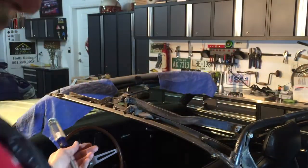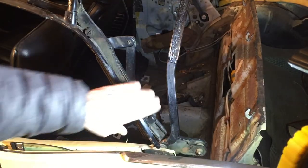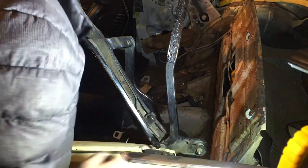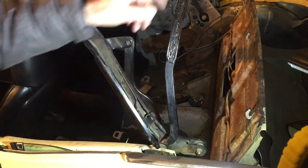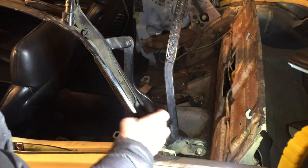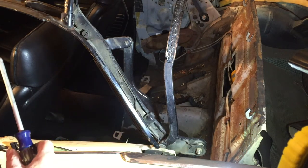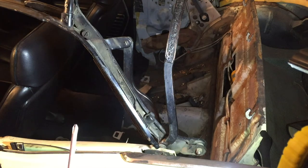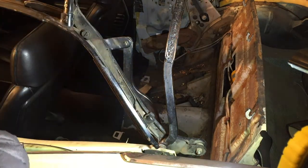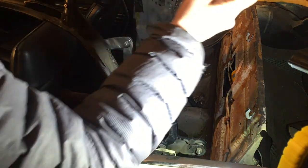There is a rubber stop right here — that rubber stop is destroyed. It looks like it's on with a Phillips screw, so I'll have to replace that. It looks like it's destroyed on both sides; it's petrified, so I'll do those as well. I'll really go over everything here and make sure all the pivot points are in good shape, all the bushings are in good shape, and then I'll clean it all up and paint it. We'll start putting it all back together.